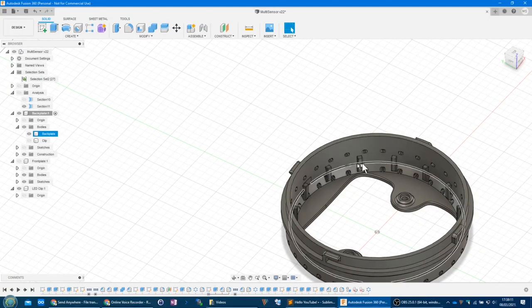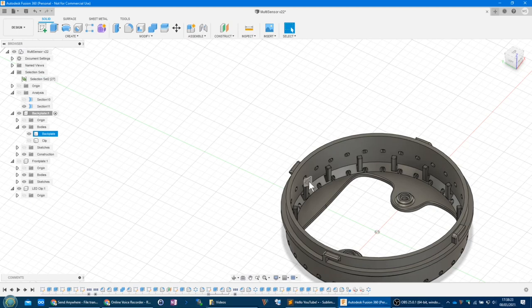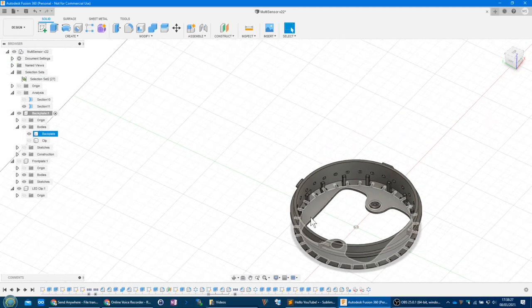And the reason that I wanted to have a long wire that is clipped up rather than just having a connector here is so that if you were to pull this by accident, it won't come out of here and put a strain on the solder joint. Also, that's just the length they were, so that's pretty handy. What else is there to say about this design?